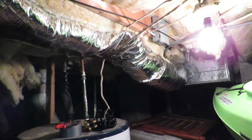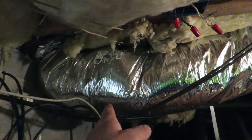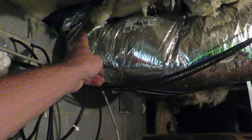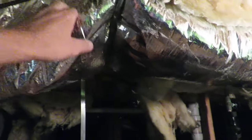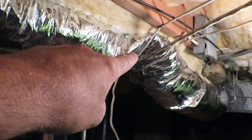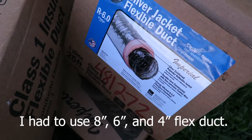I'm going to film this one section of the ductwork because this is the most lit area, closest to the door. Let's go over what we see is wrong with this picture. The first thing I've noticed is that the bend right here is way too steep or sharp going up into the air duct. Then coming through here, this has actually been put over top of some wiring, and it's pretty much pinching off the air supply and squishing the insulation above it. So you've got two bad spots where it's pinched - this is incorrectly placed.